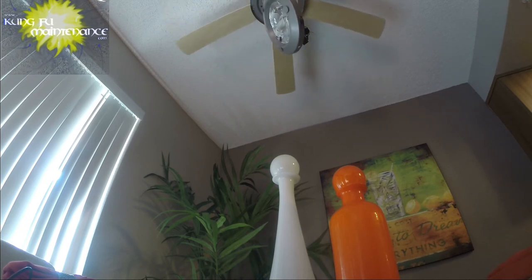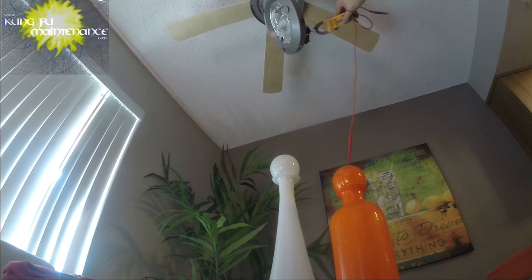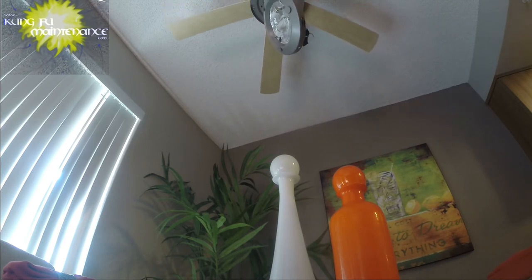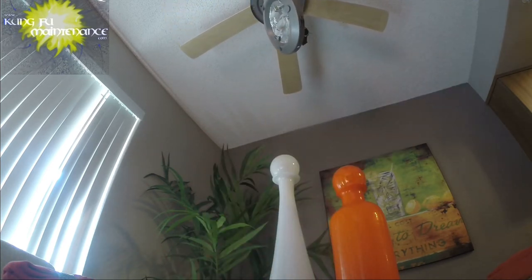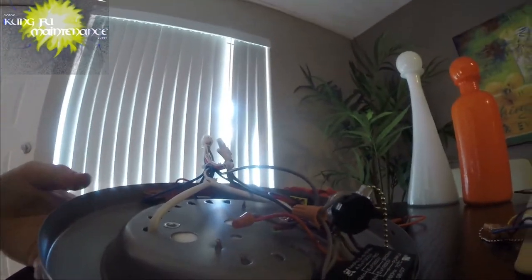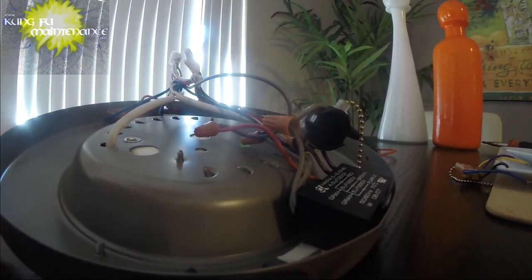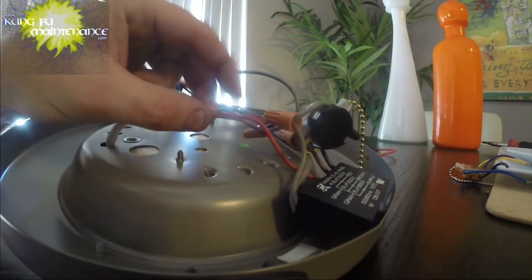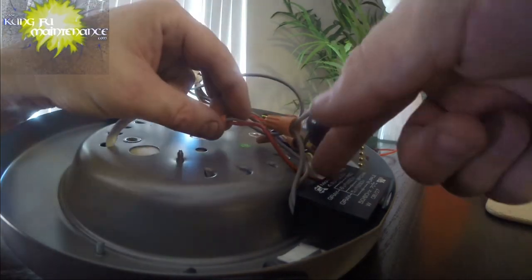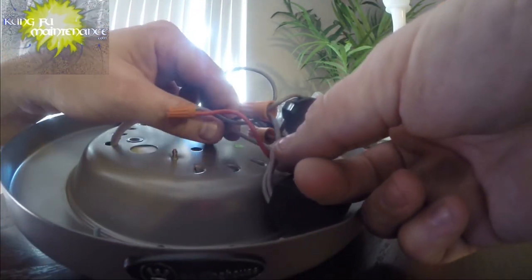Okay. Checking for voltage. Well, we've got voltage. We don't have voltage going to our other deals. All right. So I turn that off and we'll disconnect it. And our problem is different than I think. It's perhaps how it's originally wired from the manufacturer. And my thought is that these two need to switch, the red and the red. The two grays, maybe those got switched for what they should be.